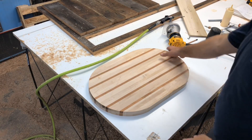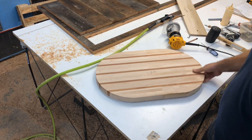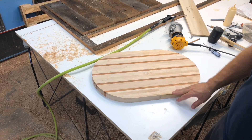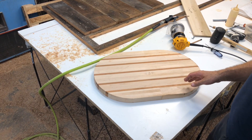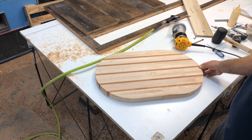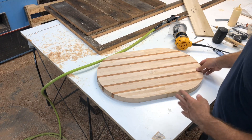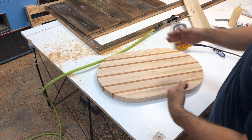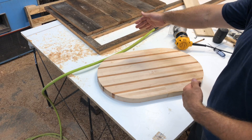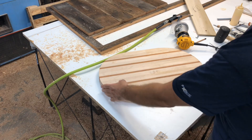And that's that — totally oval cutting board. From here, I'll give it a good sanding and use a router bit to put my profile on it. You can use whatever bit you'd like: round over, chamfer, thumbnail bit, router bit du jour — then give it a finish sanding and oil it. This ended up at 15 and 3 eighths by 24. I like to go a little bit wider rather than deep for cutting boards — it gives you more room to fan out, and the counter depth is always 24 inches give or take, so you can't really go that far deep but you can go really wide. People appreciate that.